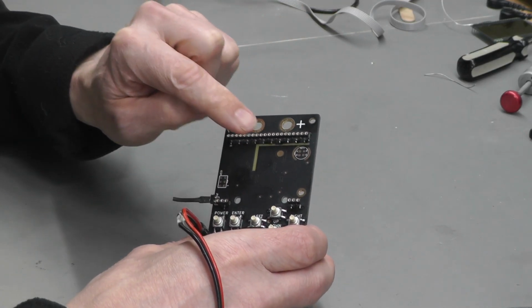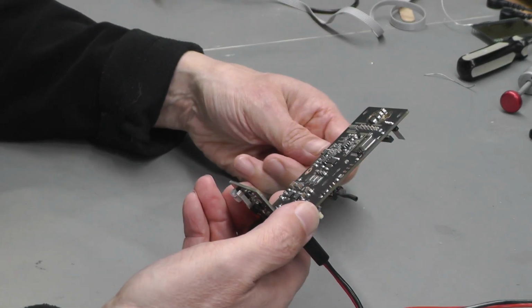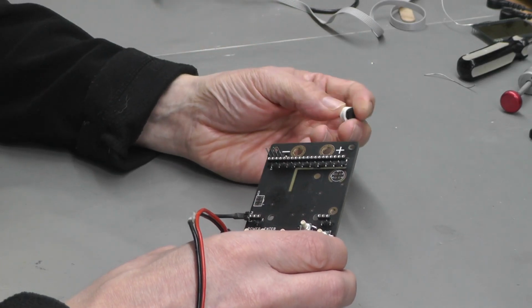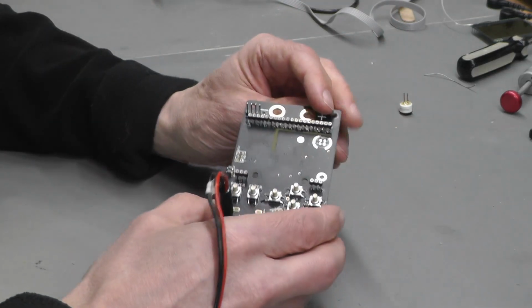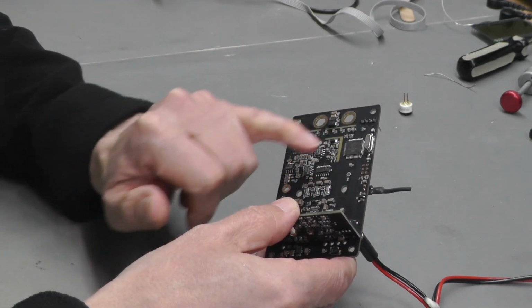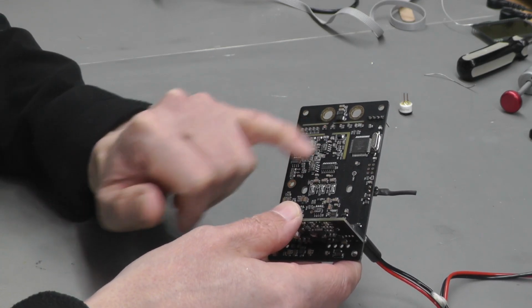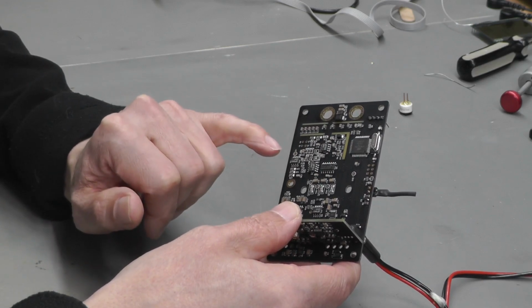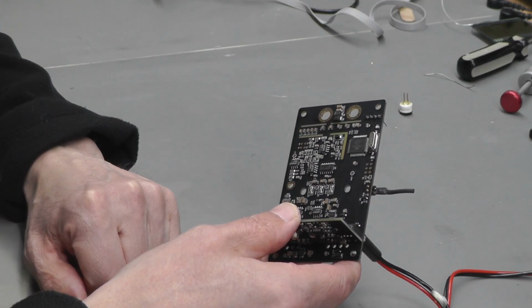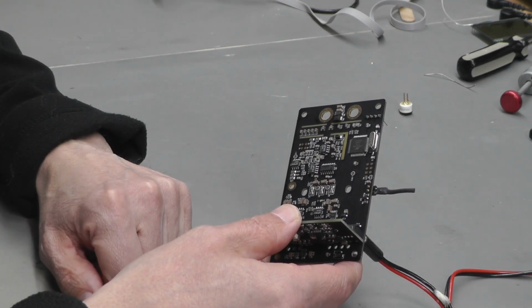The reason I don't fit the final LM399 to the board at this stage is because the board still needs to be run through the ultrasonic cleaner, and I'm not putting LM399s through an ultrasonic cleaner. I also want to go ahead and actually ramp up the DC input supply and check the various DC supply voltages from the additional regulators on the board to make sure they are working, and also test the Zener voltage and reference voltage on the circuit board as well. Part of the testing process. So let me set that up now.